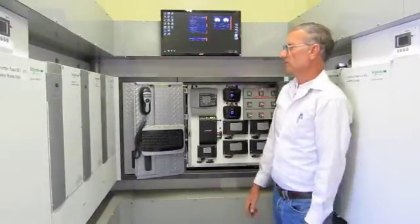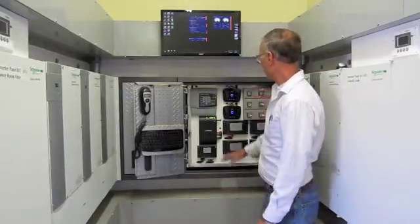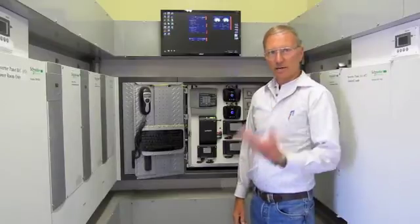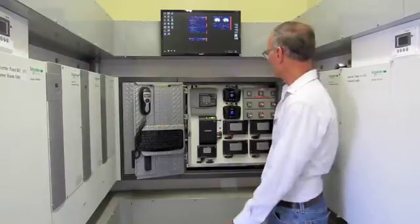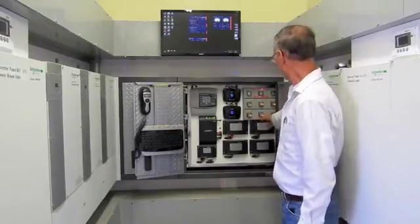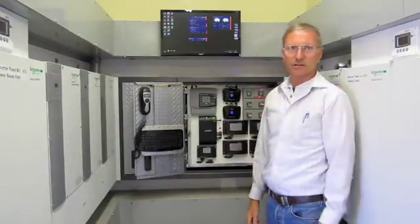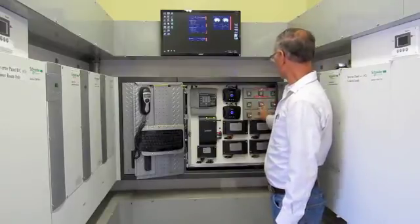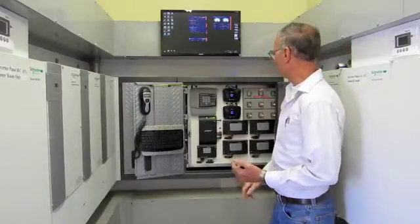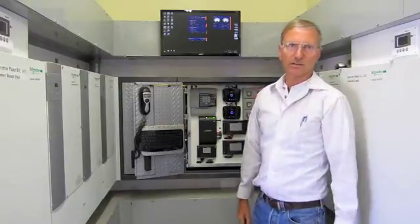The next thing they asked was, what happens if something happens? They didn't want us to always have to come up here. What we wound up doing for that was two things. This is a plain old Sensaphone 800 — something people use for monitoring power in their cabins. It gives you a set of dry switch contacts that you can dial into and actually manipulate. When we dial in, it looks for the condition of these relays over here. When these are all lit up, that means everything is functioning as it should. The ones on top are not lit because that's for the generator, which isn't on right now. But if any one of the lower lights goes out, this immediately dials us and gives us a status report of which inverter went down. We can then dial back in, enter a security code, and it gives us access to start the generator.